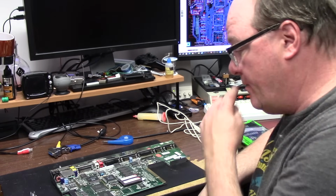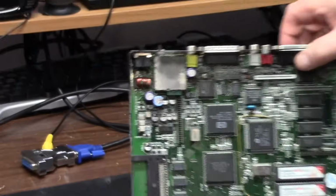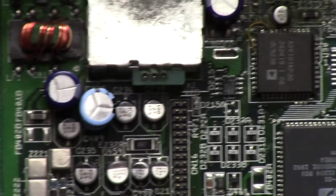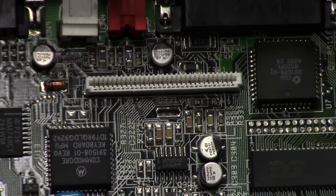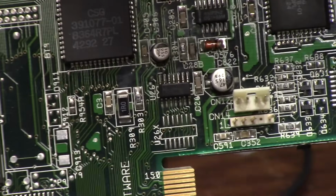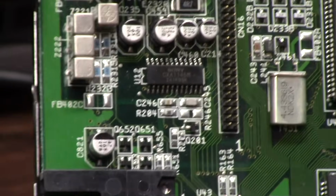Now, since this one's doing well, it doesn't look too bad. There's no major damage to this board. Check this out. Up here in the old composite video deathland, around that video encoder and the DAC, you usually have some leakage. This through hole doesn't usually leak, and over here, audio and behind the keyboard connector. So they're all good. We have one small decoupler, and then we have the small leaky ones and little bits and bobs. The CIA is hanging on quite well.